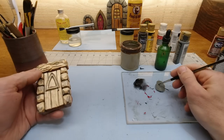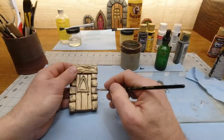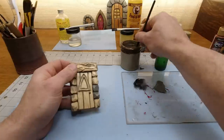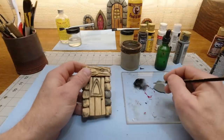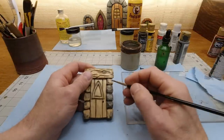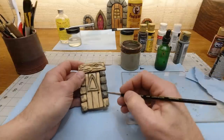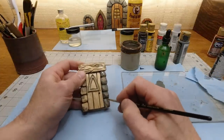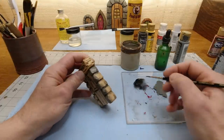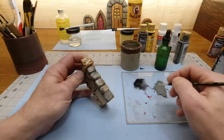Add some water — same brush, mix it up. The trick is you want to be able to see through it, but not so thin that you could read a newspaper through it — that's a little too heavy, so add some water and lighten it up. That black underneath may not do anything the first time around other than a little bit of shadow, but we may do it again. If your paint is light enough it'll come through. I'm not trying to stay out of the mortar joints — just putting it all on. It'll all come out in the end.